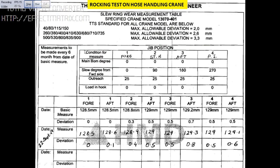You can see the readings taken — load on the hook is zero. Keeping the crane in the forward position, then starboard side, then aft, and port side — four positions, each with a fore and aft measurement. All the measurements are recorded here.